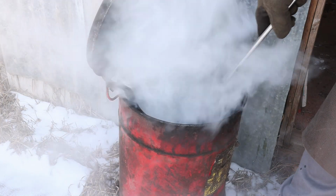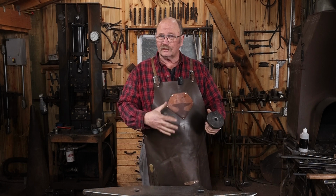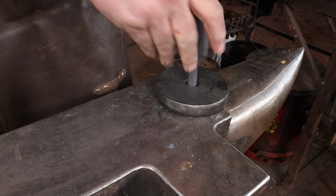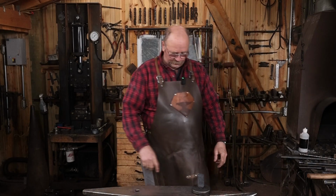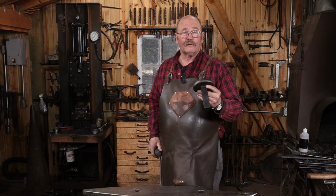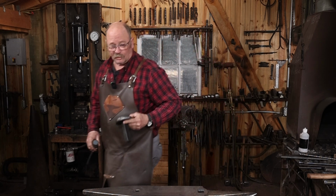And this gives us a very nice bolster that's going to stay put on the anvil or at the swedge block, and that'll allow me to pass the stem of this project all the way through. Although I may have to trim it a little bit so it doesn't hit the block for the anvil. But if I put it over on the swedge block, it's not a problem.